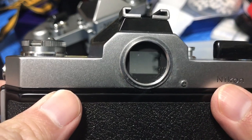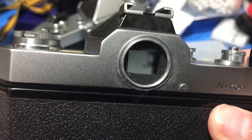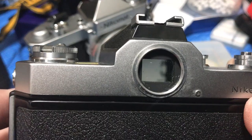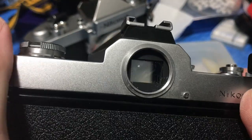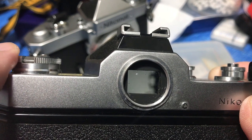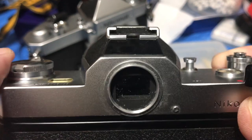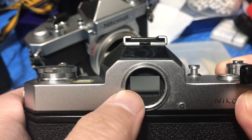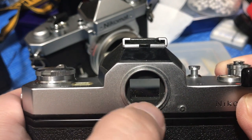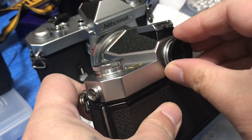As you can see, there's the galvanometer inside — it's actually just the reflection of the galvanometer, so if it moves here it should move here too. At the bottom edge of the frame you'll see your shutter speeds. It moves by way of a cord inside the finder mechanism.